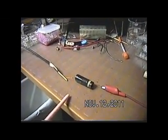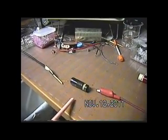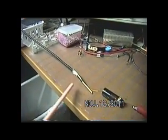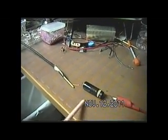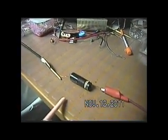I can demonstrate this to you — exactly what's going on in the 3-coil, and what you have to look for, and how you make it work. This lead right here is a piece of ordinary coax, 50-ohm coax. I've pulled it back, and I'm using it as merely a coupling to the end of this coil. On this end of the coil, you can see this clip lead is just going down to an earth ground — and it's not even a very good earth ground, because it's going through all of the bench and down through the electrical system to finally get there. But it is an earth ground. It's not the mains neutral.